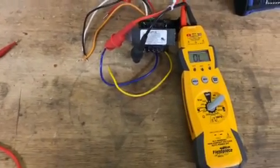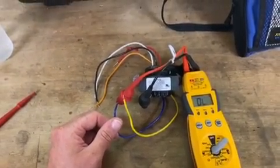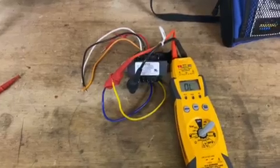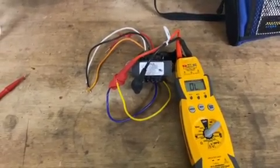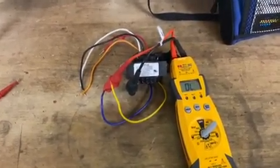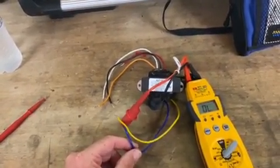Before you replace because of a 24 volt issue, you may want to check out — before you go putting one in and turning the power on — see if you have a short somewhere in another area, maybe a contactor or some other type of relay, fan relay or whatever. You can also put an inline fuse, so that way if anything shorts out, it'll blow the fuse versus your transformer.